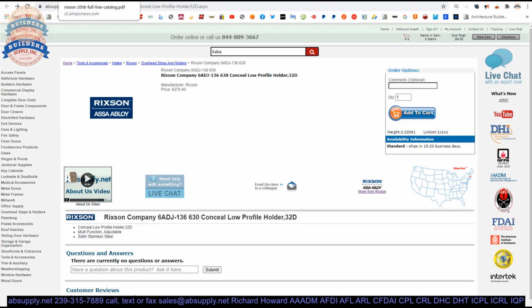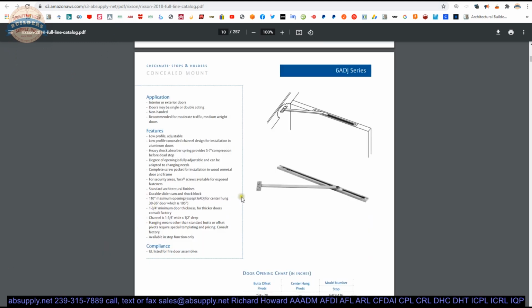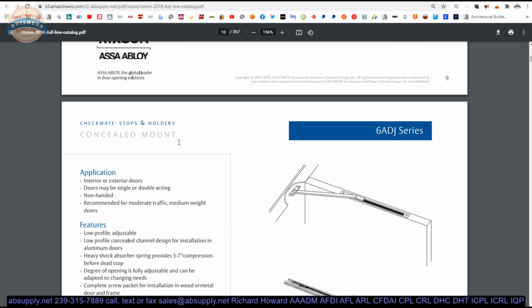Now, there is a link below this video to the cut sheet. Let's take a look at the cut sheet. Here's the cut sheet, and it gives a summary overview of the Rixson 680J. So what I do when I'm looking for an overhead stop, I'm looking for surface or concealed, and then I'm looking for standard duty or heavy duty, and then I focus on any derivatives. There might be multifunction, adjustable, low profile, things of that nature, derivatives under those two top categories.